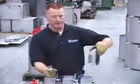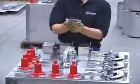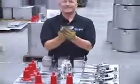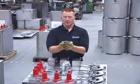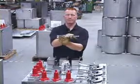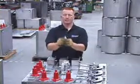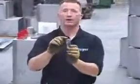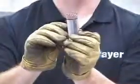I have here a container of 10C transformer oil. This liquid level gauge is a static device. It has no moving parts that can fail. It's simply an acrylic shaft with a prismatic bevel machined to the end of it. In that prismatic bevel is a red and white laminoid card with the words low oil machined onto it in reverse.